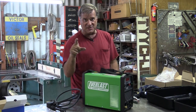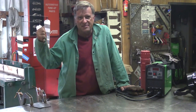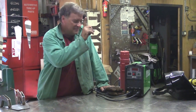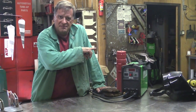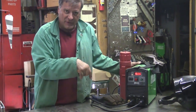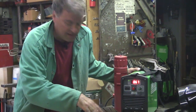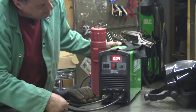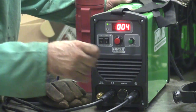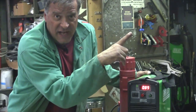Okay, let's hook this puppy up and make some sparks. I've got some 1/8-inch cold roll plate steel cut out of a bucket. We'll slice it in half with the shear, clamp it down, and weld it back together using the stick welder with some 7018 rod. I've got it on 110 instead of 220. The minimum amperage is 4 amps and the maximum looks like about 89-90 amps on 110 volt.